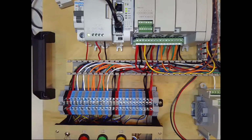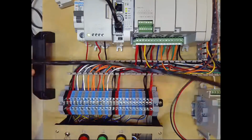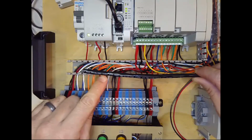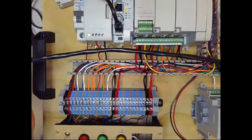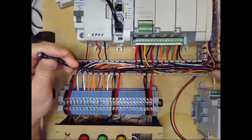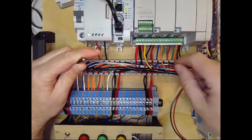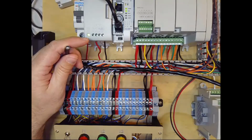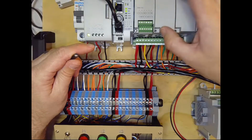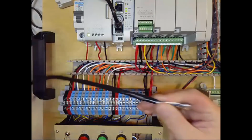So now let's talk about the wire we're going to use. In your kit, you'll see that you have a piece of this black wire. It's got 2 twisted pairs in it and an overall shield. Reading the side of yours, you'll probably see mine says shielded there, and then I'm missing the rest since it's a relatively short length, but probably yours will say 2 twisted pairs and the wire gauge on it. So this is instrumentation cable. It's got, like it said, 2 twisted pairs, and we'll go ahead and save the pair that we're not using. Obviously we just need 2 wires for what we're doing right now, but don't cut off the other 2 that we're not using, because later on, if we have time in this class, we'll add an analog output module as well. Because of the weather delay, I'm not sure we'll get to that this time, but just know that that's why we have 2 twisted pairs.